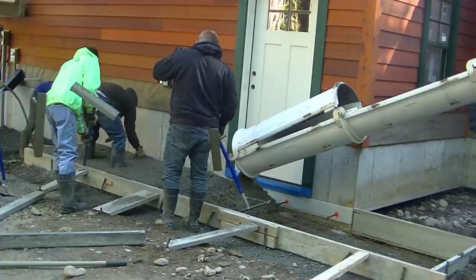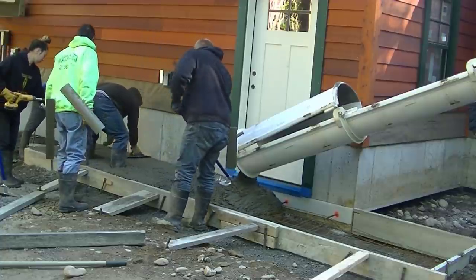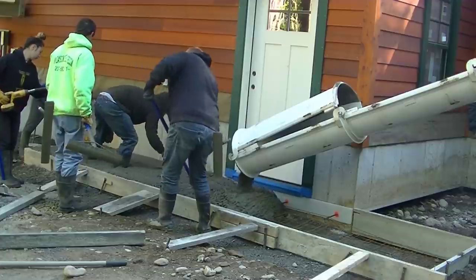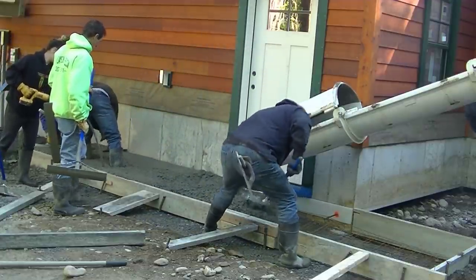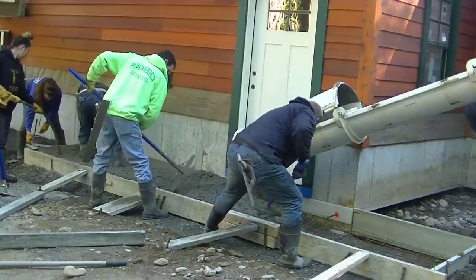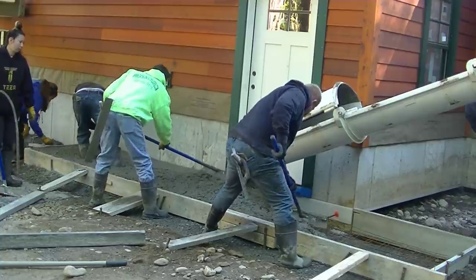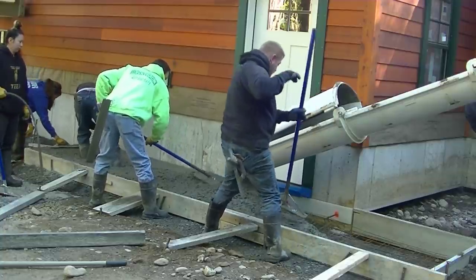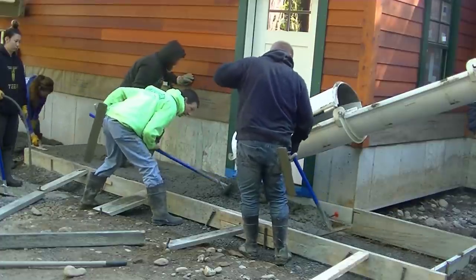What Tia's doing is she's using my DeWalt pencil vibrator, just vibrating the edges so when we strip the forms the concrete will be really smooth — no air pockets, no rock holes. Abby's in the back mag floating the edges, getting them nice and smooth, while Darren's magging the edges to the top of that expansion foam up against the building.